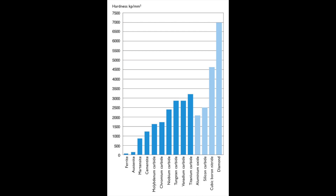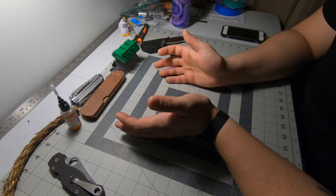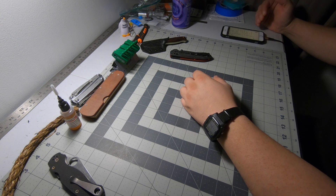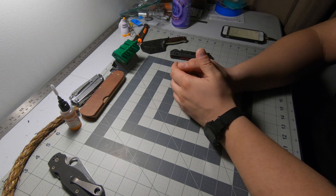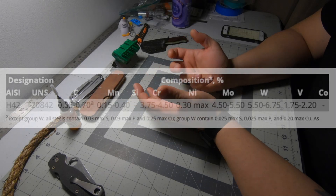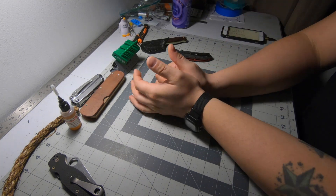There are arguments online about which carbide is harder, but they're all within the same hardness range — they're all pretty hard. Then H40 through H59 are molybdenum-based steels. Moly helps with hardenability — the penetration of hardness into the steel — and also helps with grain structure.